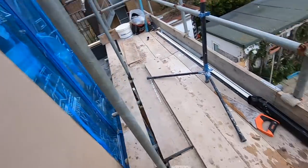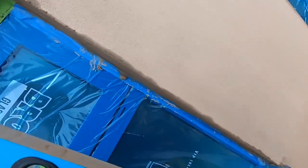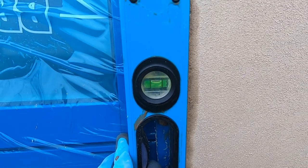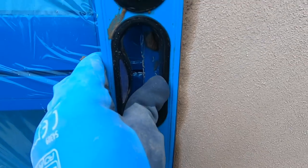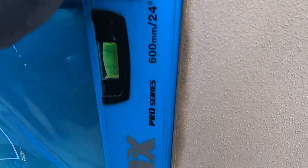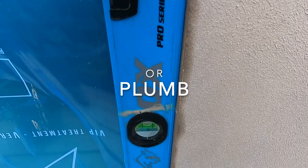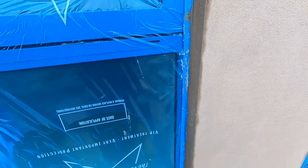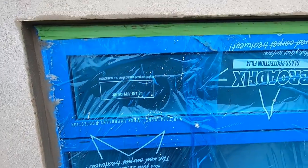Now let's run a level, see how we're looking. There are no gaps along that bead. I'm going to check the back edge — there's nothing you can see — and it's perfectly level, so that one went well. Now I'm going to leave it for a few minutes, get another few reveals floated, and then come back and sponge it.